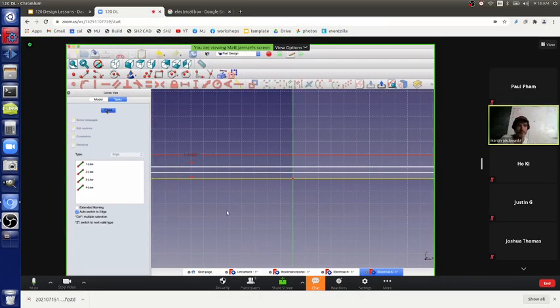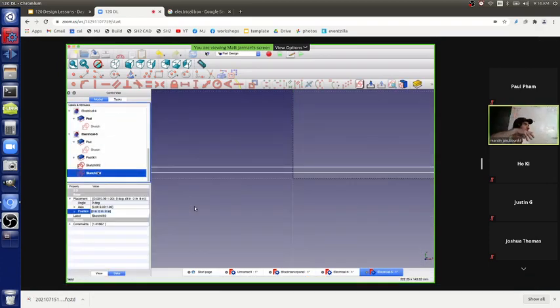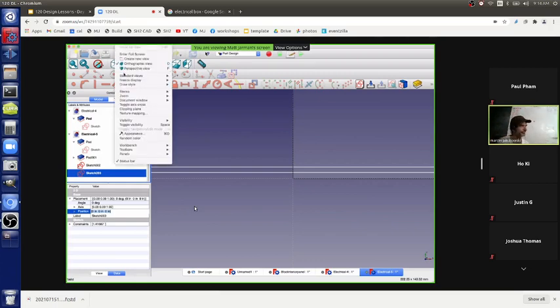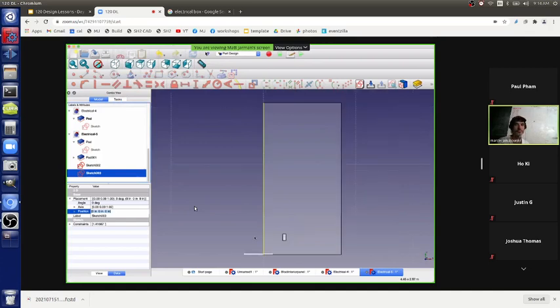We're trying to locate this. Our question is, we're doing CAD, we're learning how to do it rapidly. How do we do it? I'd put a constraint wherever we need it, so then you can draw the object and constrain it. You could do that. A constraint between the point 0 and the bottom left corner of your electrical box sketch.